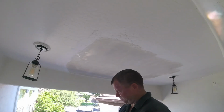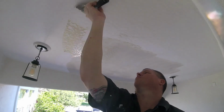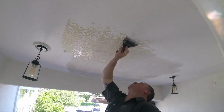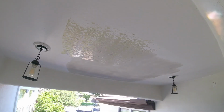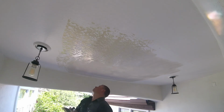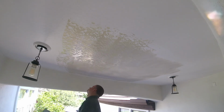As this third coat's setting up, it is outside. That's why I'm using a joint compound. I'm just going to turn around, let it set up for an hour or so, and then I'm just going to do a skip trowel texture. Your project might not have a skip trowel texture, so the process is the same. Getting it first coated, second coated, and third coated is the same for any type of job before your texture. The texture is just you're matching what you have at your project.